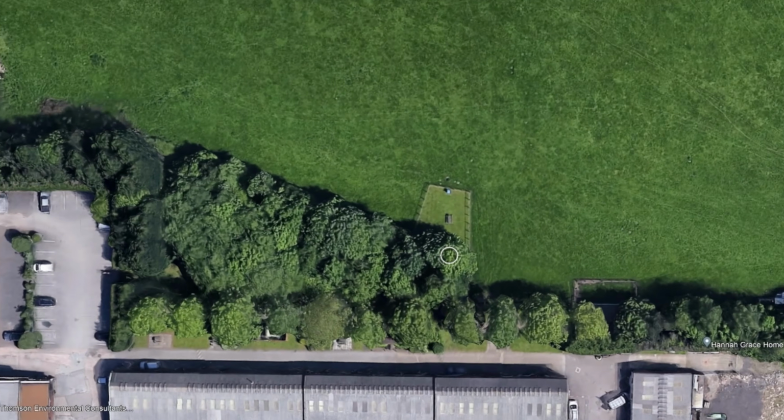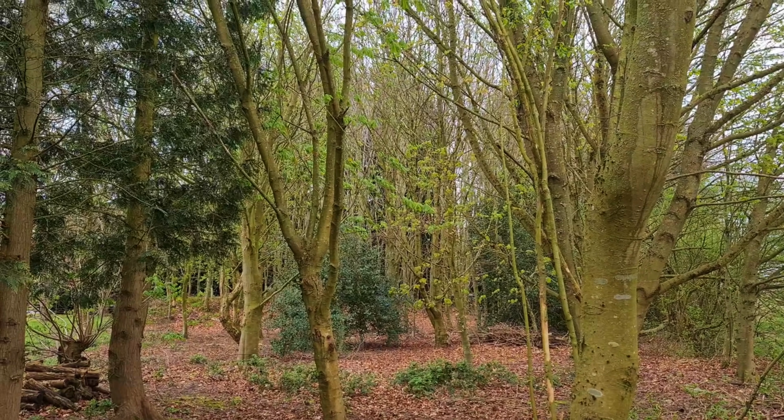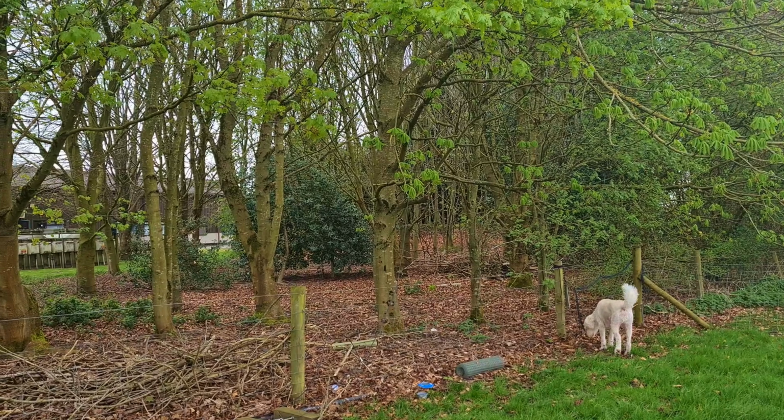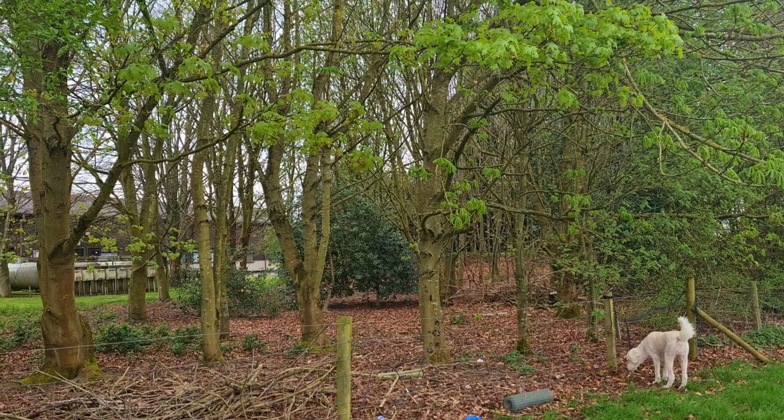I've got some heavy, dense trees, and conceptually, I haven't been putting it off because I've been on holiday and doing the DX Engineering order, but I keep walking out to this plot where I want to put this 40-meter Delta Loop, which will give me 40, 20, 15, and 10, ideally for receive. That's the whole point. But it should give me a great transmit on 40, during the day, that sort of thing.